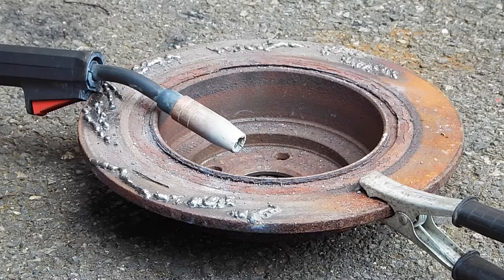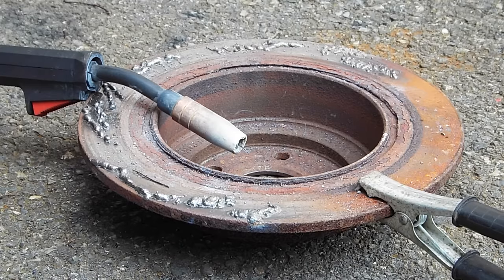All in all I've got some good melting going on at the end of the gun. A little more practice is needed to get a good bead going, but it does seem to have enough amperage to melt even the 0.035 wire. It's important to me that I have a 120-volt welder I can plug into any outlet — that's why I did this conversion starting with this AC welder. This unit is only rated up to 90 amps, and the bridge rectifier I've got in it now is rated for 150 amps. With the aluminum heat sink it seems to be holding up very well and should last for quite some time. Comment away — tell me what you think.